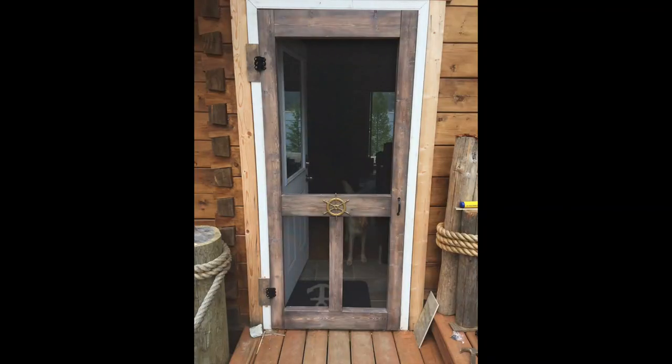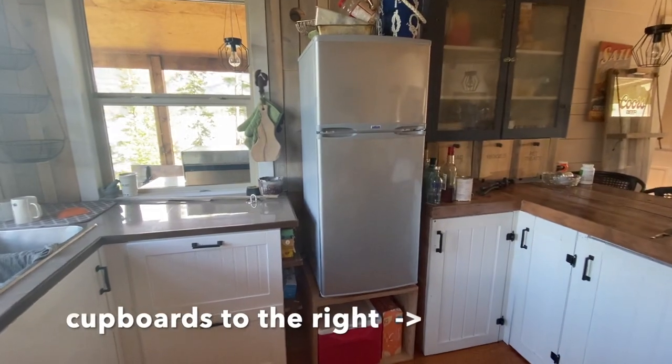Which is nothing, really. I have built a screen door before — I'd say that was average — and I've built some pretty shanty kitchen cupboard doors in my cabin. Whether that actually helps me today I don't know. I think a door should be strong, it should be square, it should have a diagonal brace to prevent sag or drop, it should close and open, and it should allow for movement because wood expands and contracts. That's why I'm using tongue-and-groove boards that were given to me.